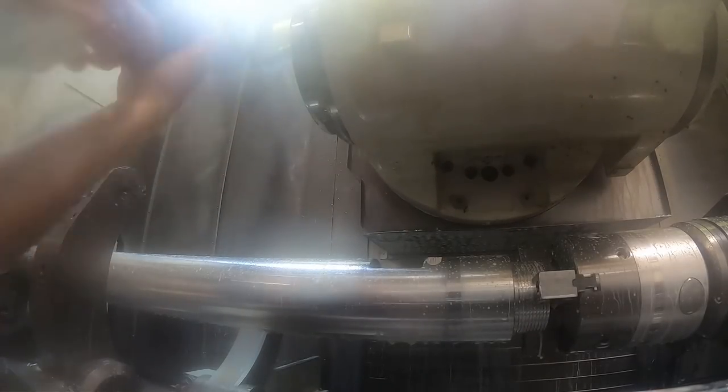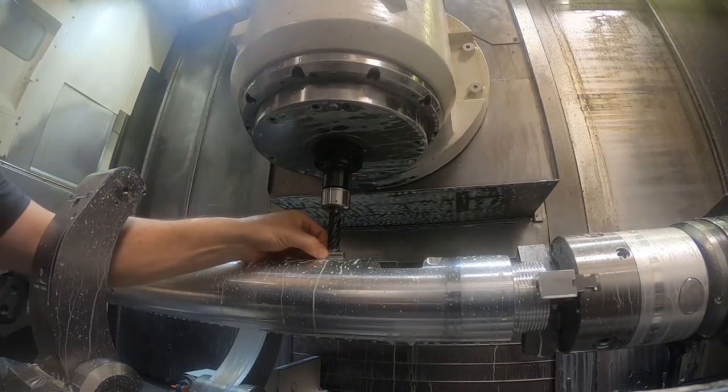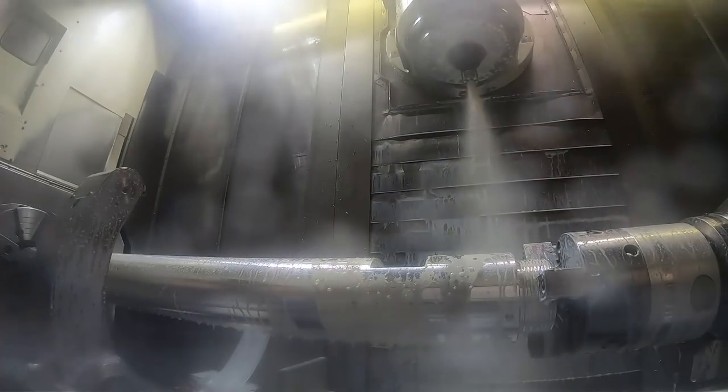And the reason it's in that kind of collet chuck, I don't normally hold an end mill in this kind of a collet chuck, but I need the clearance on the collet nut, you'll see in a second here. Otherwise it would hit the flats, or the sides, I should say, of the notch with the nut of the collet chuck. So I needed that smaller diameter. Normally I like to hold a tool like that in an end mill chuck.